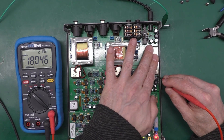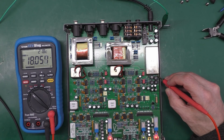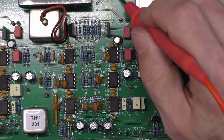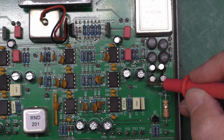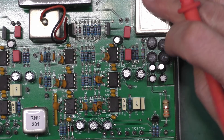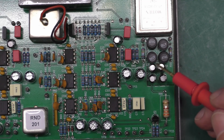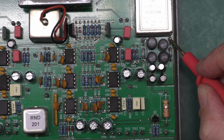I gave it a little tap — it's quite warm. The power supply circuit sits on its own ground plane, separated from the analog side, joined at a controlled point so ripple doesn't influence the rest of the circuit. Those four caps must be on the DC-to-DC output — now reading minus 19 where it was minus 18. I'll replace those caps and come back.